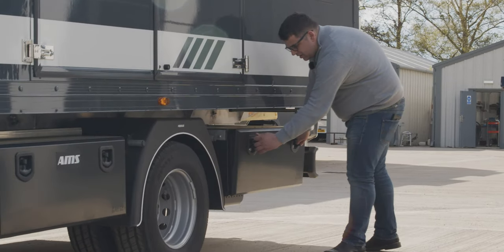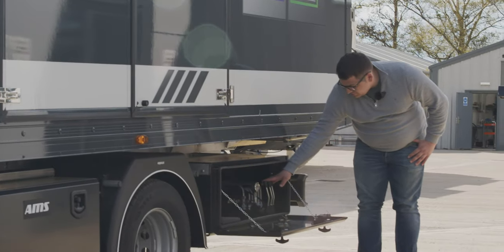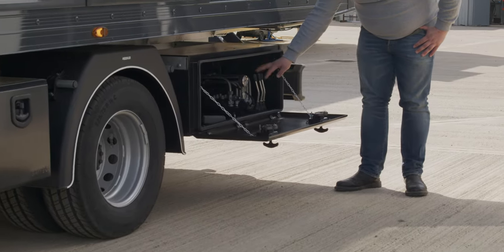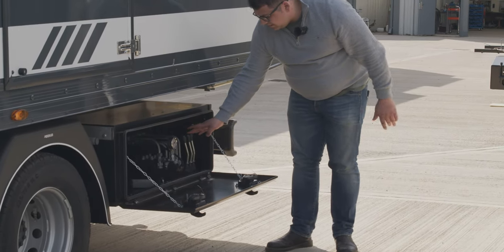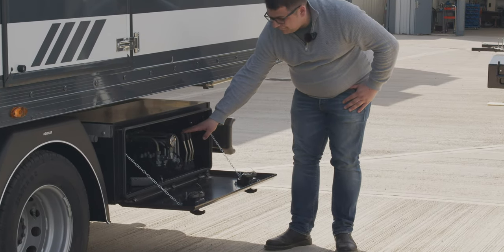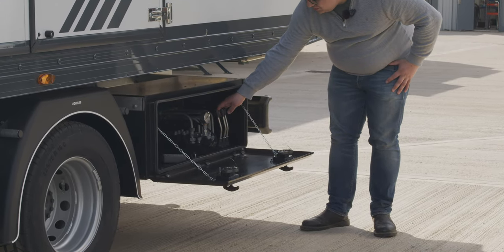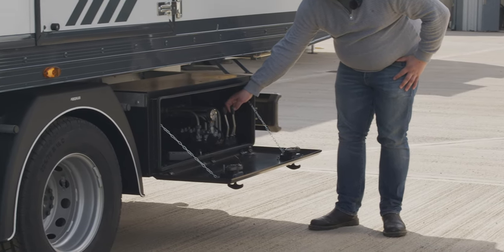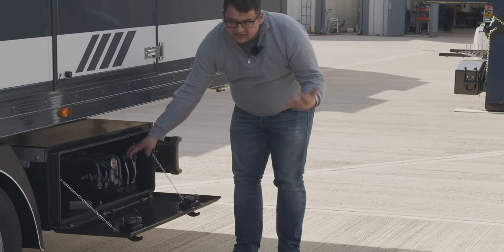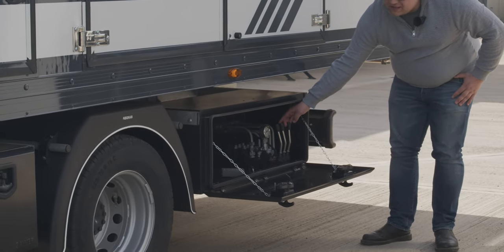Come to the left-hand side to use the hydraulic system. It's very straightforward — it's all in this toolbox just here. Flick it just like that on both sides; this then opens up. You've got three separate systems: the one on the left-hand side is for the winch inside, the center one is to tilt it forwards and backwards, and this one here is to go up and down. Before you do any moving up and down, you have to move it at least two feet — this is so it doesn't get caught up in the system. It's a locking system to keep it safe.